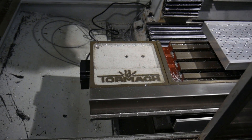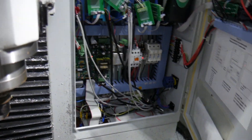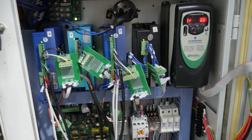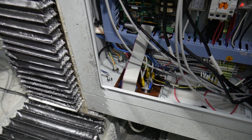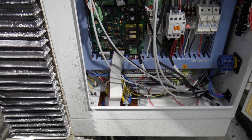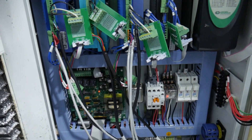You get the added benefit of higher torque, more speed, and the reliability of feedback. Going to the electrical cabinet — the breakout boards will come with a mount. All of this will run through your cable conduits. Once we get the appropriate fittings in, that'll allow you to run it through the conduit. These are all the old drivers — please disregard those.